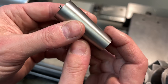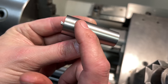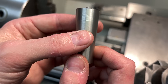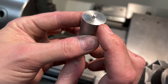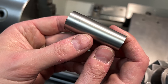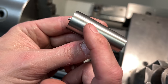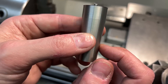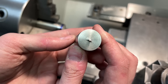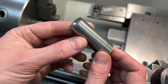That's looking pretty good — I think it's going to work out nicely. It feels really good in hand. You should be able to see how the taper comes to right around here and then flattens out. That flat spot is more than just a cosmetic feature — that is what I'm going to hold on to when I flip this around to drill the through hole and the counter bore in the back end. If you're planning on making something like this yourself, that's something you might want to consider: you're going to end up with a tapered part at some point, and depending on your order of operations you might need to hold on to that part again, so plan for it. The last thing left to do is clean up the back side, drill my through hole, give it a counter bore, and the handle will be done.